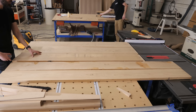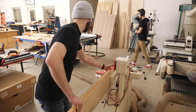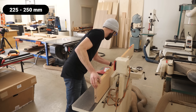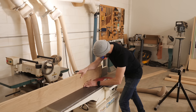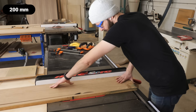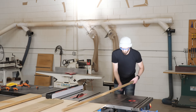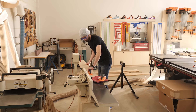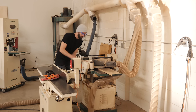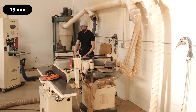It was more a matter of just making sure I was being as efficient with the boards as I could. Once I got to this point, the next thing I did was get everything milled up to its final thickness. The boards I was using ranged from about 9 to 10 inches wide, but my jointer maxes out at 8 inches. So here I'm joining one edge and then using that edge on my table saw to rip the boards to just slightly under 8 inches. Then we go back to the jointer to get one face nice and flat, and take them over to the planer to bring everything down to finished thickness — one inch for my bed rails and three-quarters of an inch for my headboard.